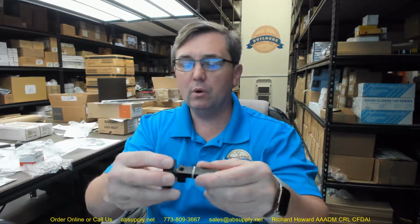The RY200 does show a reference to the adjustable stylus assembly, and that document appears to be a bit out of date, because they're coming up with a different part number. Let's see if the manufacturer's website has a more up-to-date parts manual. Okay, so we don't have an updated parts manual, and I'm not sure where that MA380 part is coming from, but in the RY200 you're going to have the ability to very elegantly adjust your stylus, your cutter, and your carriage, and bring your keys into tolerance.